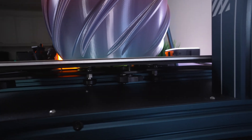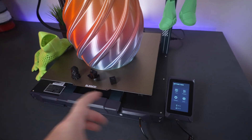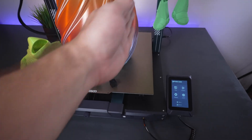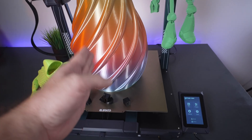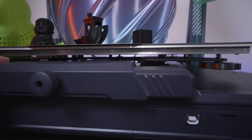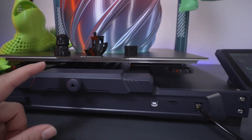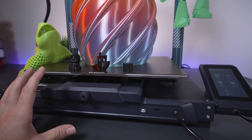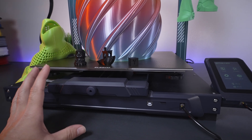We have three adjuster knobs for the bed. Something to note about leveling this bed manually is that the two stationary points in the middle are fixed. You want to start with the middle and then adjust out to the edges. If the middle is a hard point with no adjustment, start there and work outward, then use auto-bed leveling to tune it out. Mine tuned out super well, with very small differences between every edge.